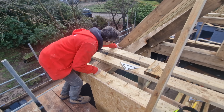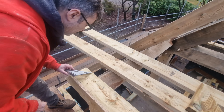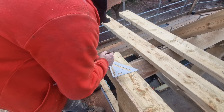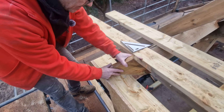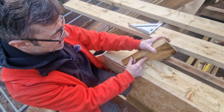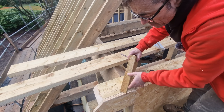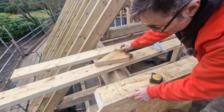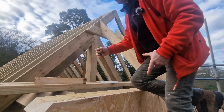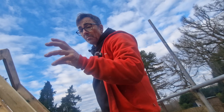At the bottom, our pitch line — which is two-thirds here — we transfer that across and square it back. That is effectively the end of our building. If we put a 45-degree line from the corner back, that is where our hip is going to sit — it's going to sit on the centre of that line. Pulling that through gives me my length. That's effectively where the hip is going to come down — the width of the hip. That's my point of measurement to the corner of the bird's mouth from this shoulder here. So I'm going to go and cut the point and the bird's mouth at the top and try it in.